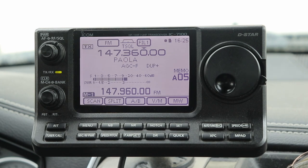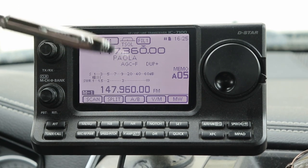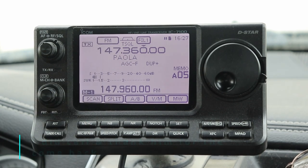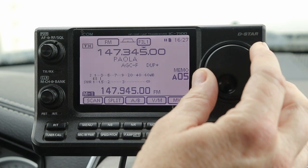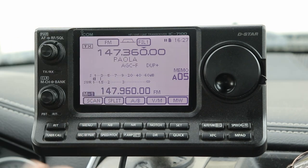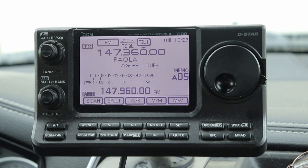WA2IVD testing — and there we are, back on the repeater again, and I can key it up. So just a little quirk to be aware of, especially using this rig mobile and especially with repeater programming. This has tripped me up a couple of times where I was off frequency, used the dial to go back, didn't really think about it while driving, and then couldn't get into the repeater and wondered what was going on. It doesn't put all the other settings back unless you actually recall the memory again.